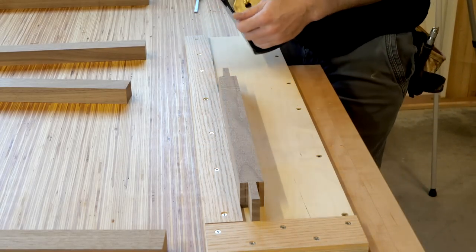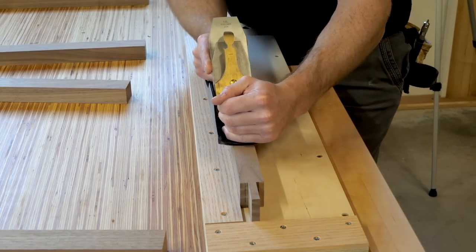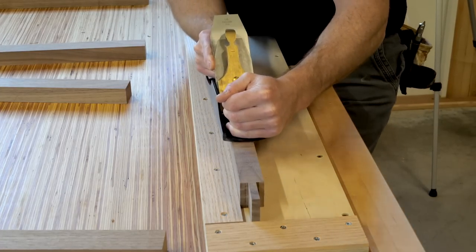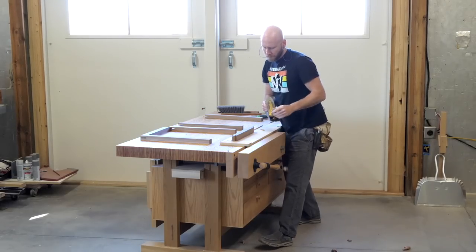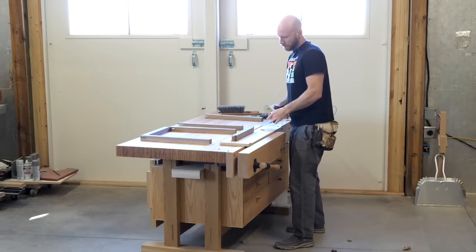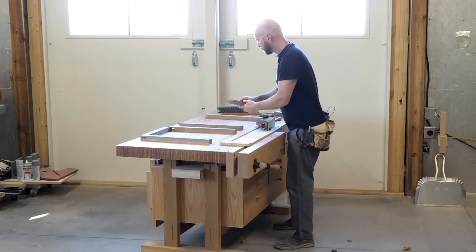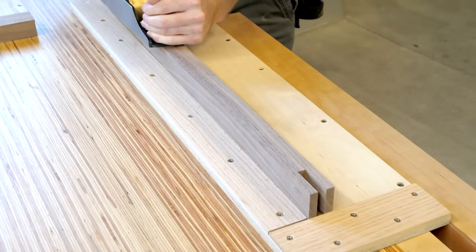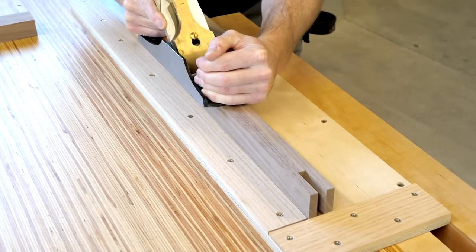For straight and square parts like these, there's nothing better than a hand plane for cleanup. I'm only doing the inside faces — the ones that can't be planed after glue-up. I take a couple passes just to knock down the band-sawn surface. On the last pass or two I pay close attention to the shaving — I'm looking for a full width and length shaving with no interruptions. This is how I know the surface is ready.